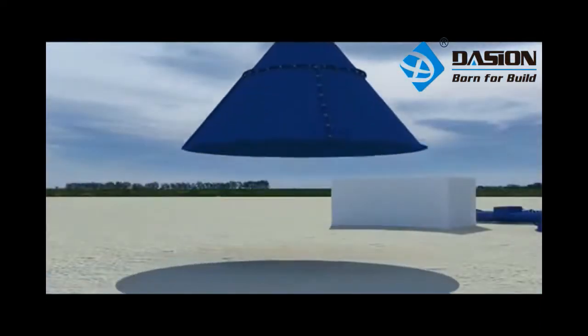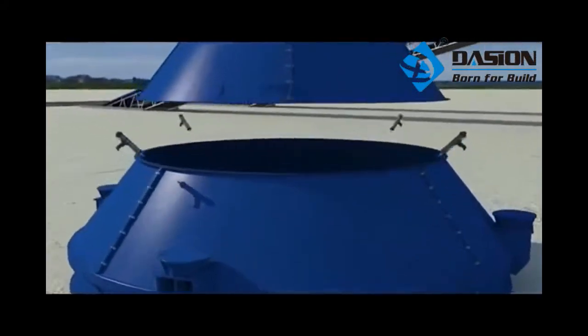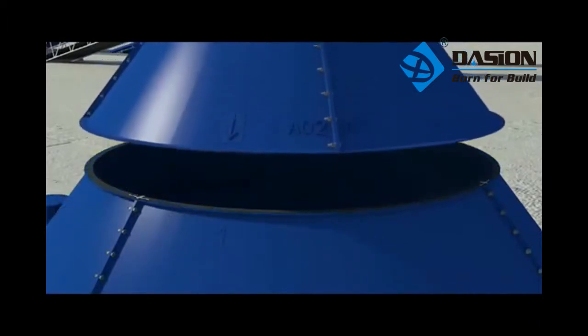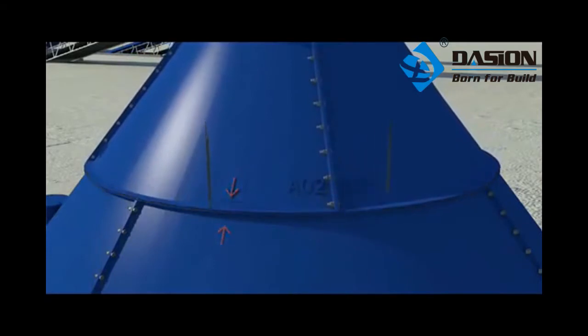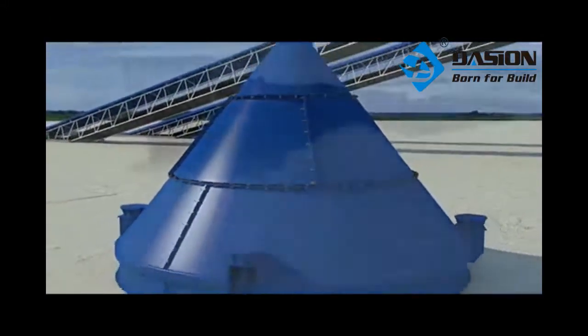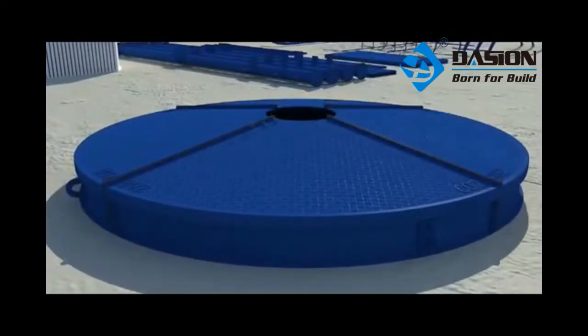Lift the combination of a small cone and a middle cone and use the same method to connect the large cone as one. Apply the sealant at connection of a transverse joint and longitudinal joint. Thus, whole split lower cone is assembled completely. The upper cone is assembled in accordance with the assembly method of lower cone and middle cone.